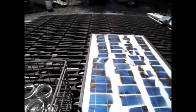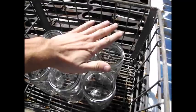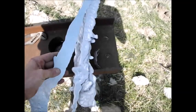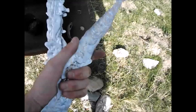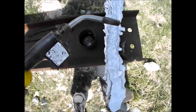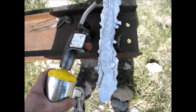So let's go ahead and make the lead plates. I'll be using this recycled lead. I've actually melted it all down in one big pot and then ladled it onto a steel plate - that got rid of all the impurities and will make it flow a lot better when I melt it again. For the second melting, I'm just going to use a torch and a tin can because I don't plan on melting a whole bunch at a time.